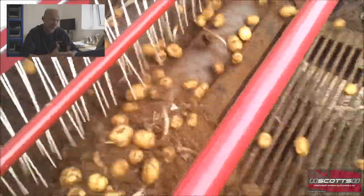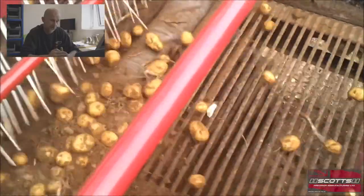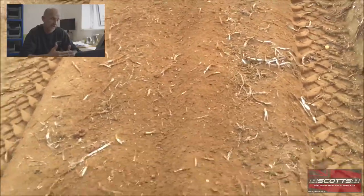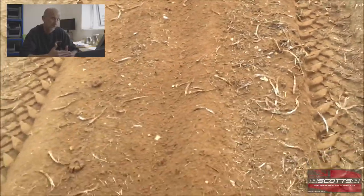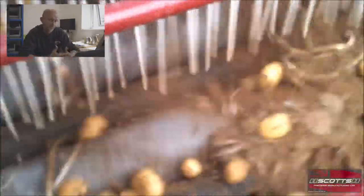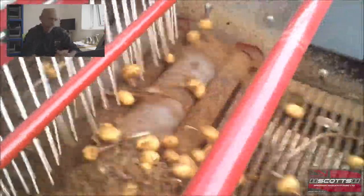We talked earlier about what type of clod roller to use — we run stainless steel, mild steel, and the most aggressive is rubber. Our preferred clod roller for salad potatoes would be stainless steel. However, as you'll see in this video, it's a very short separator with only two pairs of rollers, and we're actually running rubber on this occasion. Even though we're running the most aggressive rubber clod roller, we don't get losses with potatoes — and I'll explain that as the video runs. In the field we have a lot of loose soil coming over, which acts as a lubricant and reduces aggressiveness. In an in-store environment where conditions are drier and there's no loose soil, we would really want to be running stainless steel.